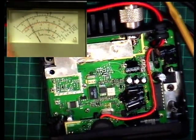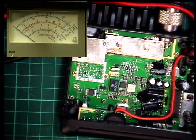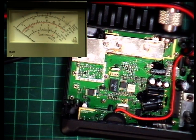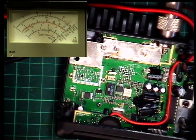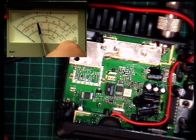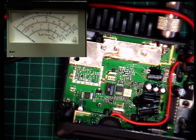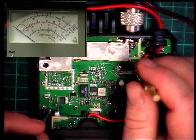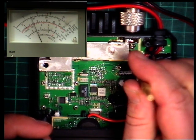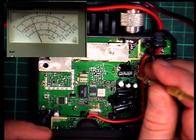Let's see what it does. This mic — these are an unwieldy thick thing, it's heavier than the radio. So we are on... I'll start off on the 3-watt scale so we should get full-scale deflection. We do, but only just. On the 30-watt scale, that's 5 watts, so that's 4 watts. And it's 3. So I wonder if the preset we can't see is the power adjustment for the 4-watt setting — yes, it is. And the maximum that will do is 3.5.